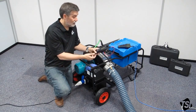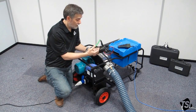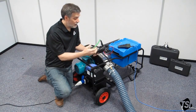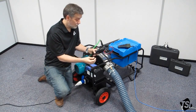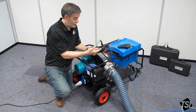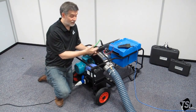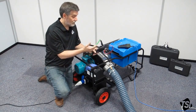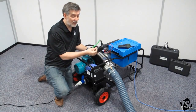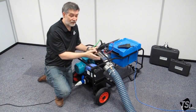We've already got this one in the leakage test screen, so it's actually reading flow values but it's not doing the logging yet. The important values are the leak factor and the leak limit. The leak limit is what the standards specify that you mustn't leak greater than. When you get the leak factor, if it goes higher than the leak limit, then it's going to fail. This is now going to run for five minutes, so we're going to start it — it's now testing. These values will pass — I can see they're below the leak limit. At the end of the test, we'll get a pass or a fail. If you get X's instead of values for the leak factor and leak rate, then basically it's gone under range. That doesn't mean your test has failed — it just means that the leakage rate is actually lower than the Panda can measure using the flow grid. You then need to use the low flow nozzle and switch over to that to measure the lower flows.